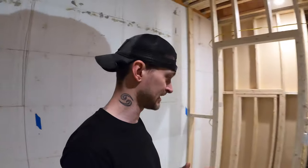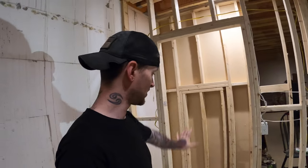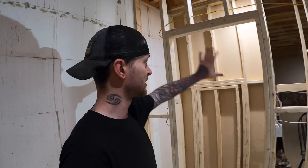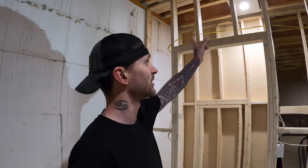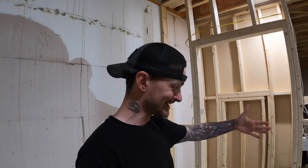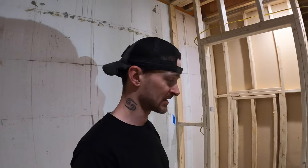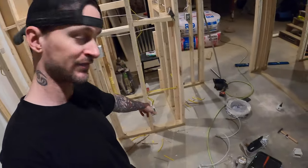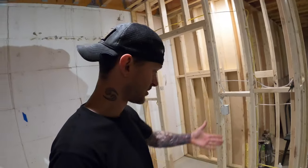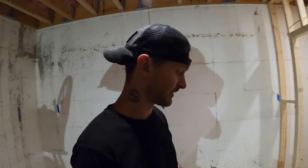But today and tonight, I just want to mainly focus on we're going to insulate this wall to help with sound transmission. Then we need to go ahead and put up the drywall. We could do the ceiling inside of the closet too, and then pretty much probably everything on the inside of the closet. I'm not going to do anything on the outside because I think the electrical inspector would still have to look at the outlets and stuff. So that'll give us access to the front. But anything behind there, we really don't have to worry about.